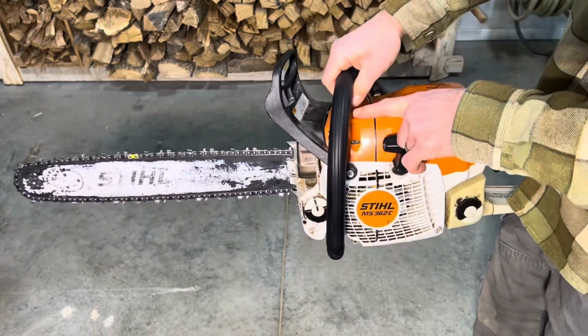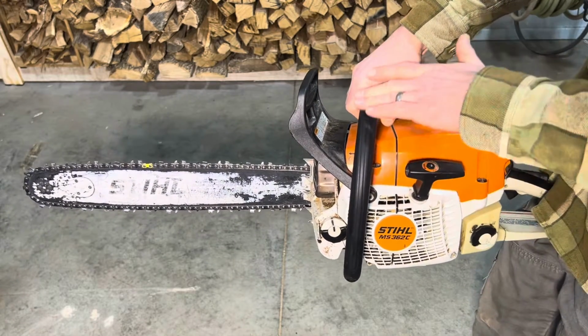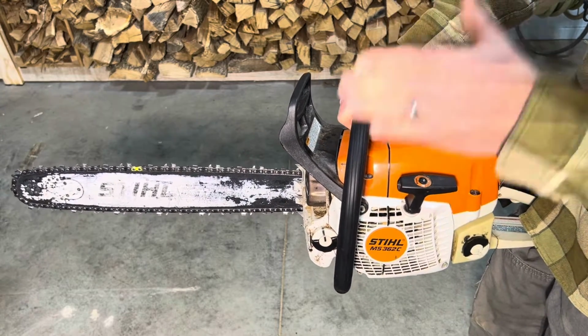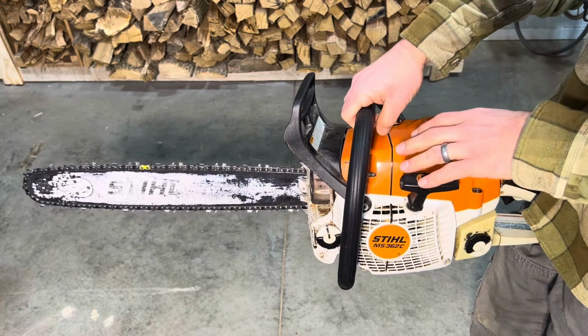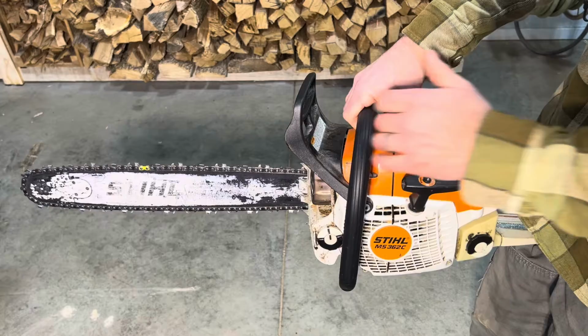And the angle that I want to make you most aware of, that you're probably not, is when you grip inside this corner here, the saw manufacturer has designed and balanced these chainsaws so that when you begin your face cut or your first cut down into the wood, you're going to automatically, by the weight of the saw, be able to access around a 70-degree angle depending on your grip.